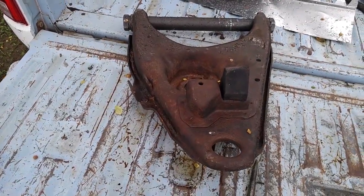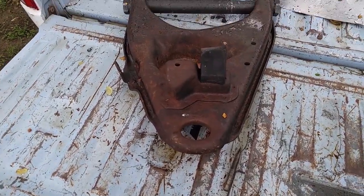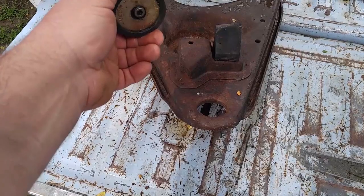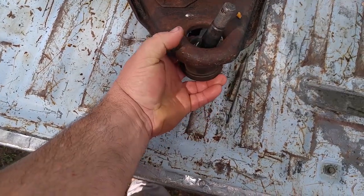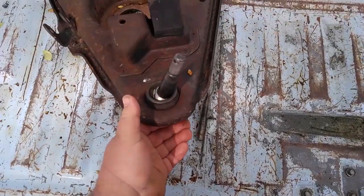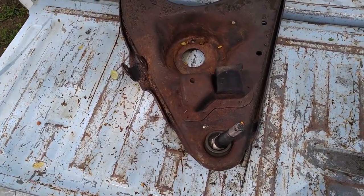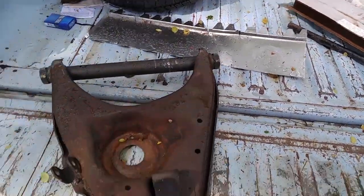Well, the rain let up for a little while so I need to get back to work. This is the one I thought had pressed in decently — took a little pressure to press in — but all the beating and pounding and banging trying to get the bushing out knocked this back out. Not all the way, but I had to tap it out. I could tap that in there with a hammer just by a little bit, so I'm going to set that up and use some more shim material again.